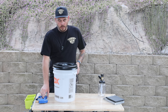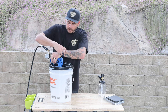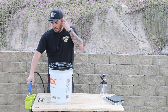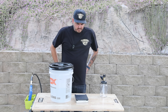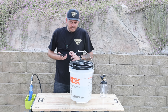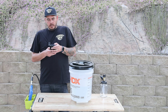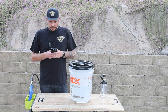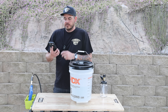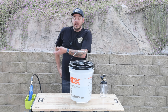We're going to fill the bucket for one minute again, then weigh it out and see. After one minute with the Washer Pro, I'm at 317.8 ounces. That's 317.8 minus 40.9 divided by 135.5, giving me 2.04 GPM. So less flow than the AR, but still a phenomenal amount, and slightly more PSI at 1,000 versus 950 — that kind of evens it out a little bit.